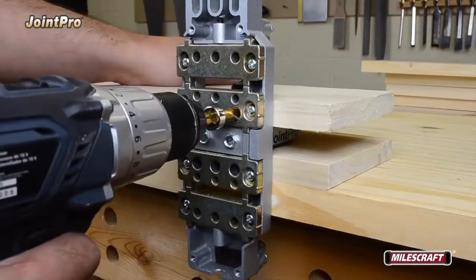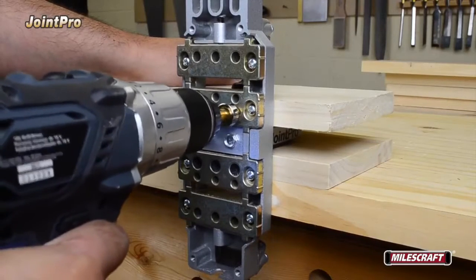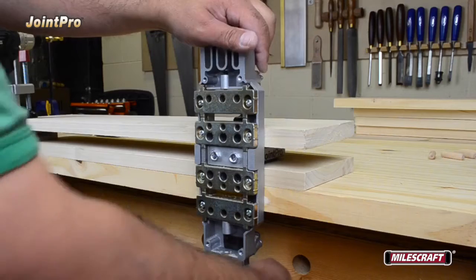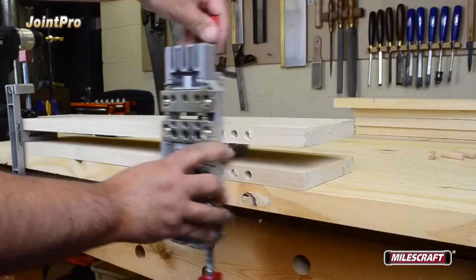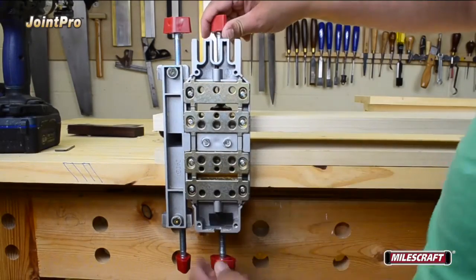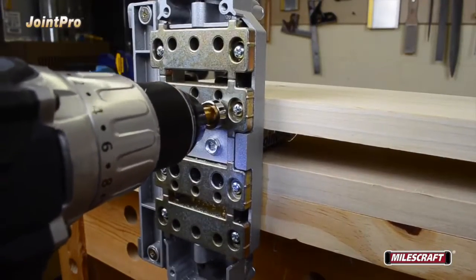With the power off to your drill, insert the drill bit into the appropriate drill guide bushing, turn on the drill, and drill a hole to its proper depth. Depending on the length of the board, you may need dowel pins in several locations. To locate these extra pins, keep the auxiliary body locked in its current position but loosen both clamps on the main body. Then slide it into position for the next set of holes, re-tighten both clamps, and repeat the drilling process as previously.